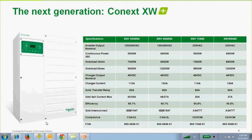120/208. The rest of world units are 20 amps sell back current as well, for the smaller, and 27 for the larger. We only have one number there because there's no split phase for the rest of the world. Efficiency, 95.7 for the UL models, 95.8 for the rest of world. I assume that tiny bump in efficiency is primarily due to the transformer, since we have a center tap transformer to get the split phase out of the UL models. All pertinent listings are there, UL 1741 CSA, IEEE 1547 for grid interconnect. I'm not as familiar with the rest of world grid interconnect listings, but AS 4777, we're compliant with that, and as well as CE and RCM, which I'm not familiar with,